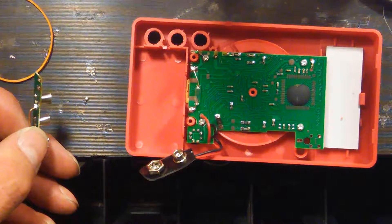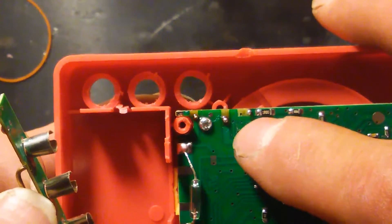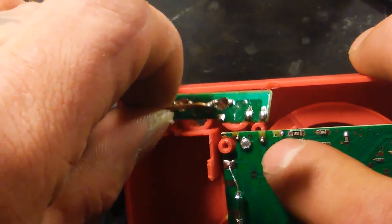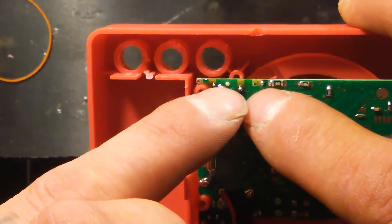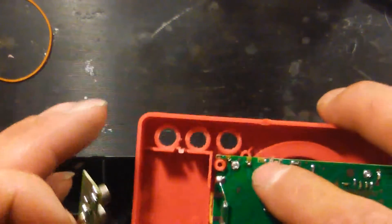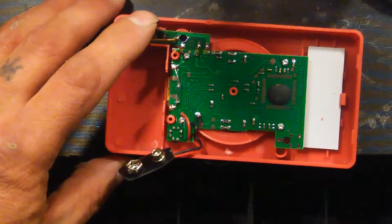Anyway, it tears the hell out of the board when you push that probe in there and it can't fit inside those tubes, so it just pushes the board up and snaps it. But I got just barely enough of the printed circuit board - scraped a little bit, got enough metal there to solder to. So I'll try and solder that back in there.